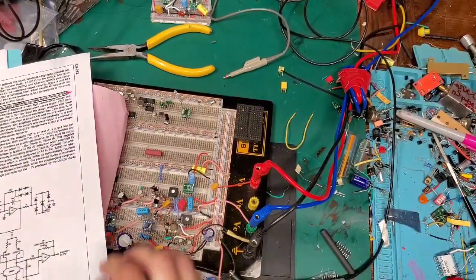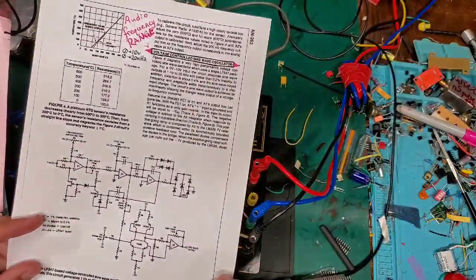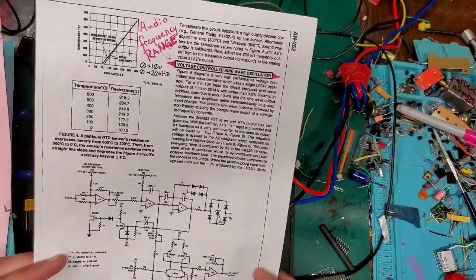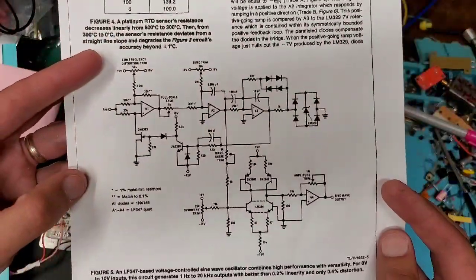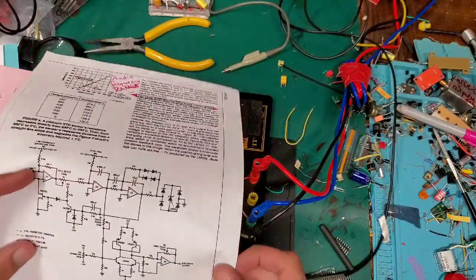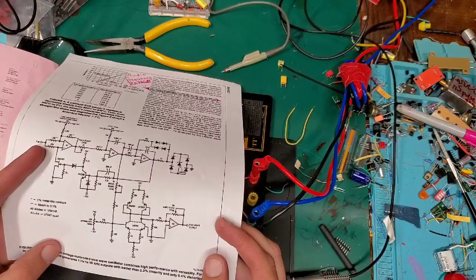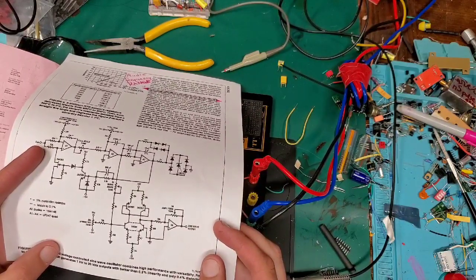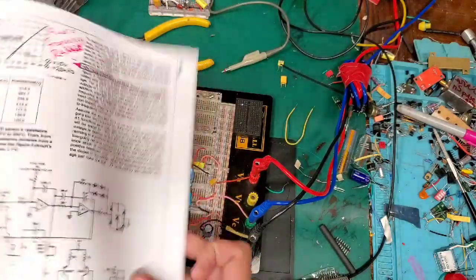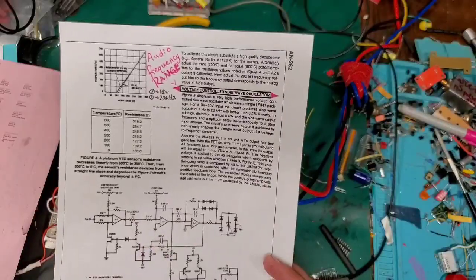Going through some app notes, as I do, I found something by Jim Williams, the God. App note 262 from the National Semiconductor Applications Handbook. It is fairly straightforward, as you can see. The only thing of moderate difficulty to get is the LM394, which even then, like the MMBT 3904s that are duals that you can get from DigiKey nowadays, are probably just as good. Anyways, he used, well, let me start from the beginning.